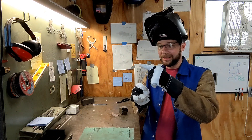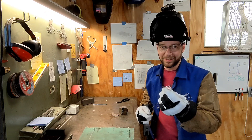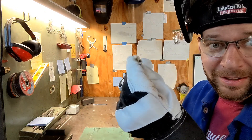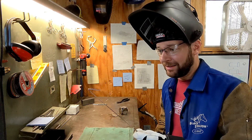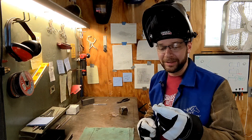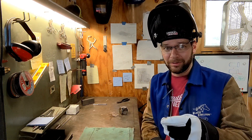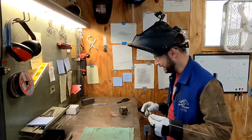Make sure you always bend the important end so that you don't lose your information on there, because the little flat area actually says what the rod is. So if you're working in manufacturing it'd be very important that you are using the right rod. Does it matter for this? No, but always bend that so you don't lose that information. Pro tip of the day.